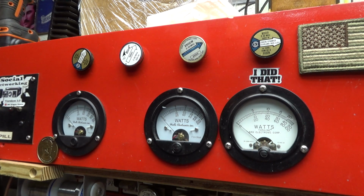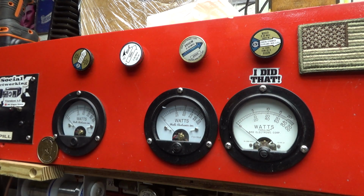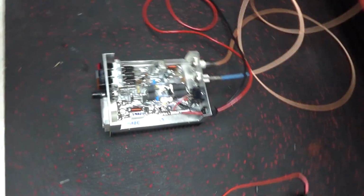Alright. Hold. Doing about 275. Reflect is looking really good. It's got an 82 puff cap there, which was in it when I got it. Hold. It's 100 puff on the output, which measures about 104 puff. Yeah, everything's, let's go back to the bias voltage on it to show that.